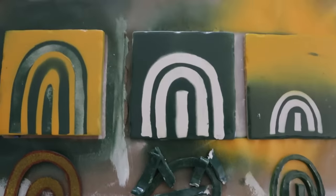In between spraying my tiles, I got started on removing the old top. Luckily, this was very easy. All I had to do was remove the old hardware from the corners and the frame and give the frame a little tappity tap with my mallet to release the wood glue. From there, I measured the height of my couch so I could adjust the leg height of the coffee table and then determined what the size of the frame needed to be to fit on my new tabletop.